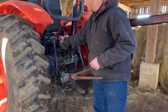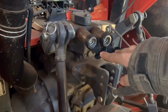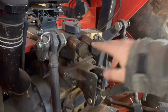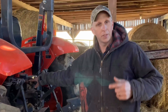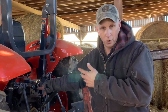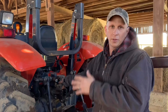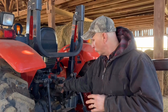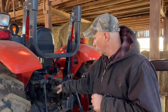While we're here, you'll see this little gadget right here. These little gadgets are hydraulic controls. This unit has 1 set on it. And when I say 1 set, what I mean is if you have something that goes up and down, then you'll have to have 2 hoses. Some pieces of equipment run off gravity, so you can let down and lift up on the same system, some of your older units. And these could, but a lot of your newer equipment has downward pressure as well as upward pressure. So that's why you have 1 unit.